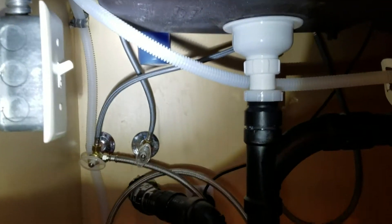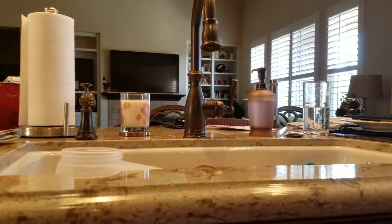The drain line is not up to code because there's no air gap; however, we did put a high loop on it, as high as it will go in the cabinet. Up above it you have the electrical conduit coming through there, so it's up high enough. It's strapped in the back and then comes over and discharges into the disposal.